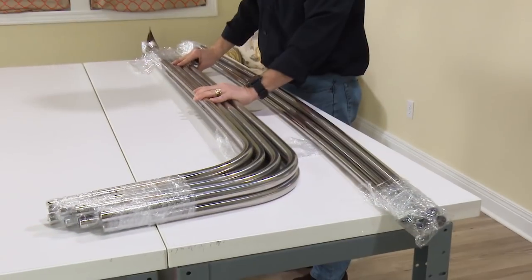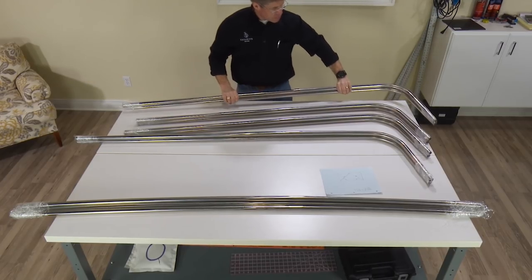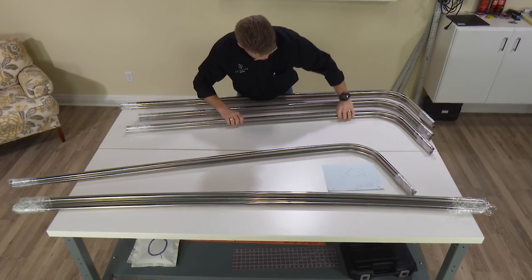If we were mounting these universal deck hinges directly to the boat through fiberglass, you would want to bed them appropriately to prevent water leakage into the fiberglass. In the next chapter we show the proper process of bedding hardware. Strap eyes are installed at the four corners, in line with the universal deck hinge. The stainless steel screws used to secure the strap eyes are included in the bimini frame kits. Now our wooden platform is ready and all hardware required to build the frame is mounted to it.